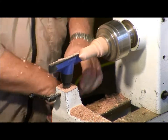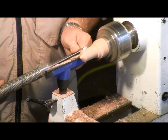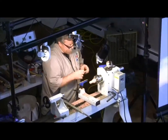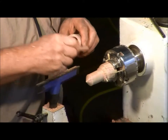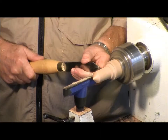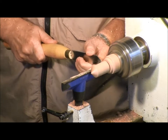No sanding — so I'm going to try to get a little closer with my tool. My little measurement thing — okay, I'll just grab this right now. I'm right there. That's pretty good, so I'm going to part it off there. Again, I'm making my parting cut wider than it needs to be, because you'll burn your tool otherwise — there's a lot of friction when you're doing that.